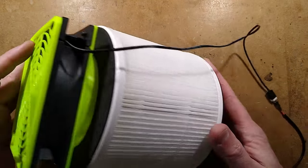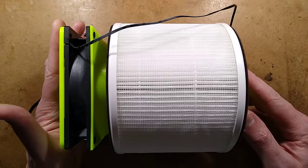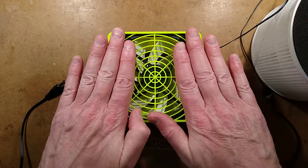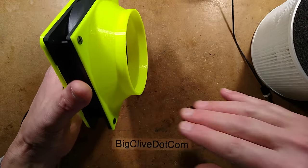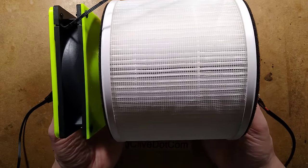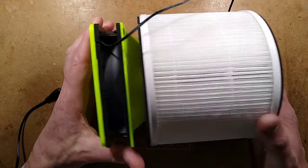If you look in the description, you will find the two scripts. If you copy them into OpenSCAD, you can adjust the variables and make this into a custom filter. Another upgrade for the future — some people say, and they're probably right, that these fans are not designed to be mounted horizontally because the bearings aren't designed for that. So another update might be to extend a plate down that goes underneath, or just make a little stand. By lifting it up, it's going to give better air circulation and let the fan run vertically.